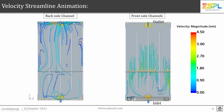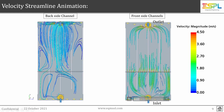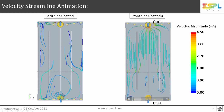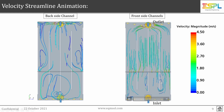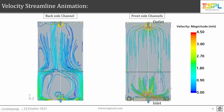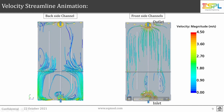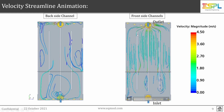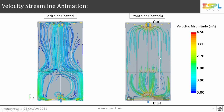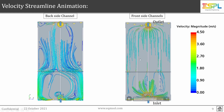So it works like it should, but to solve here, on the other hand, you have the problem that you will have the same similar pockets that we had seen on the first simulation on both sides. So I think we need to move the baffle plate right here, because after that the flow is nice and even everywhere, and it will solve many problems.